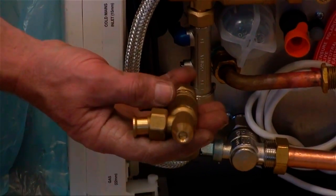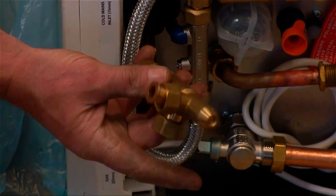There's one more thing to look at and that's the seasonality valve. You'll remember I talked about the seasonality valve and how it can be used to adjust the water flow rate according to the incoming mains temperature. But because we've got a thermal store, basically it's like summer all the time - the water is always coming into the boiler pre-warmed. So in that case, we can turn the seasonality valve and screw it fully in. Let's just have a look at where that is on the boiler.